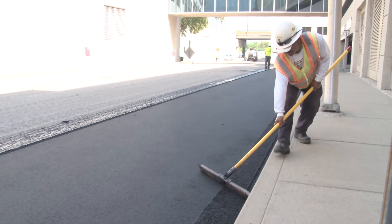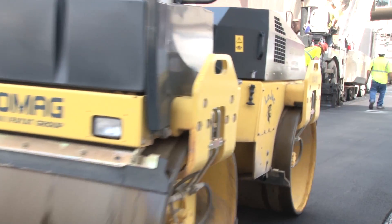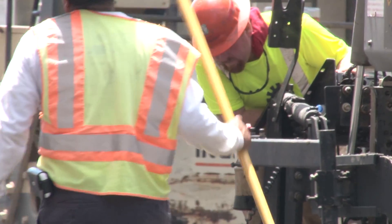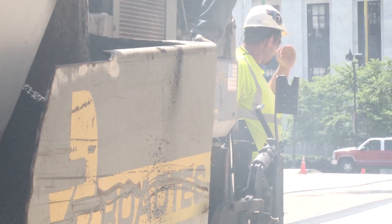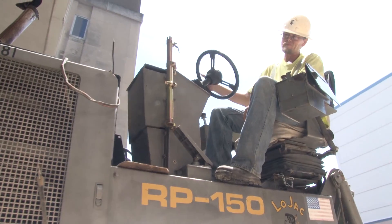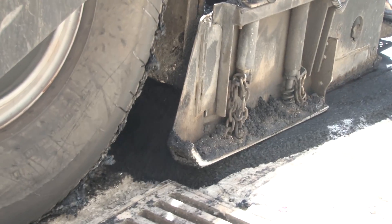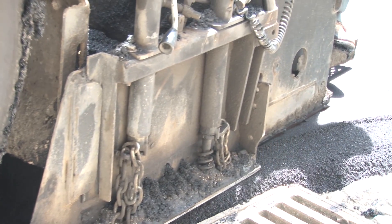Really the paving process — the actual lay down of the overlay — is very similar to conventional paving. One caveat is that it is such a thin layer, care needs to be taken on the cooling. It can tend to cool much more rapidly, so the rollers have to be on their game and right behind the paver to make sure they can get their compaction. As far as conventional paving techniques and best practices, those are followed. Also, in regards to the joints, they will probably find that with this thin mix it's much easier to work it in around curb and gutter, manholes, and working joints. Because it's a smaller, tighter mix, the workability is typically much higher and much easier, especially in a city street environment.